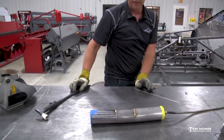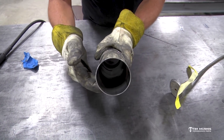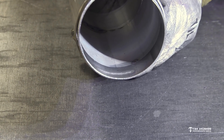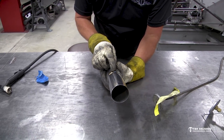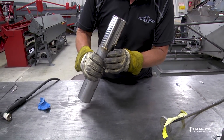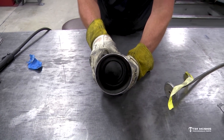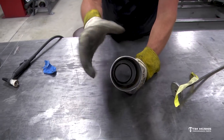I'm going to go ahead and uncover this and hopefully we can look down in there. You can see the weld is right here, but looking down inside that tube you probably can't even see the weld because it didn't burn through at all. You can tell there's plenty of penetration, but because I was purge welding it I got a nice finish on the inside. That looks really good on the outside - that's a nice width on the weld with good penetration, but it didn't burn through on the inside and you almost can't tell there's even a weld in there. If you look down past it just a little farther, you'll see that other weld where I butted it, where it's sticking up - that's what you'll have inside all your header tubes if you don't purge weld it.